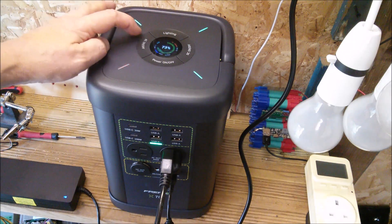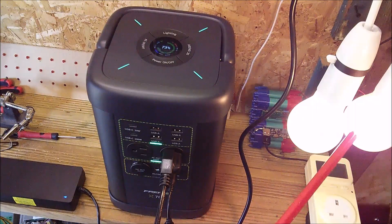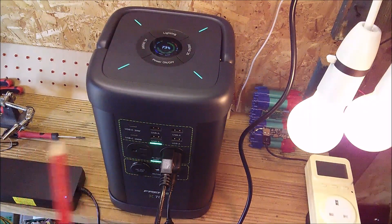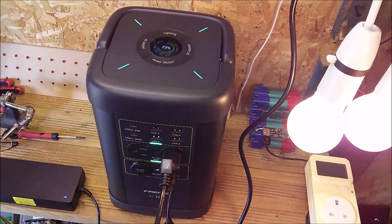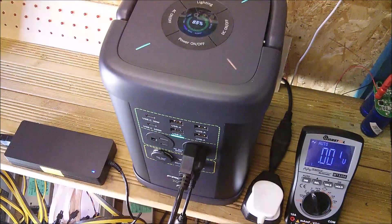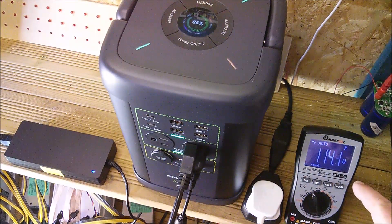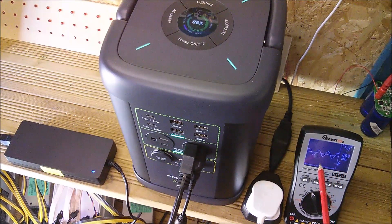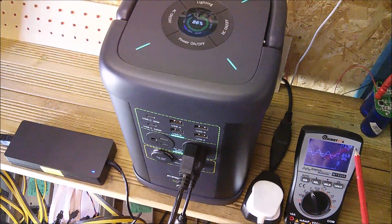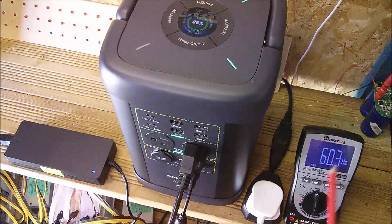Checking pass-through mode: I switch on the AC output and the light bulbs come on — quite dim as they're 240 volt bulbs. With 175 watts on the input and 55 watts on the output, pass-through mode is confirmed. Inverter output test: the output is approximately 115 volts AC — a pure sine wave — at 60 hertz, specifically 60.3 hertz according to the measurement tool.